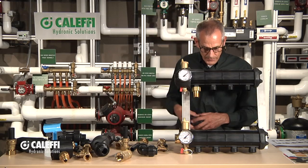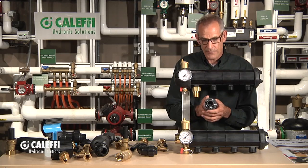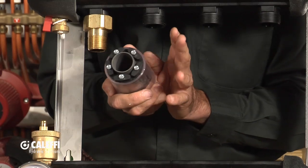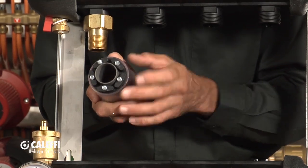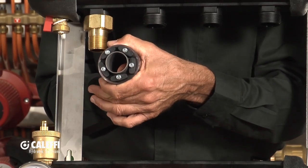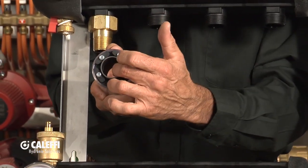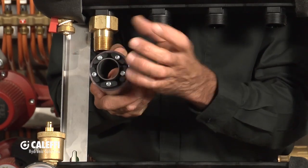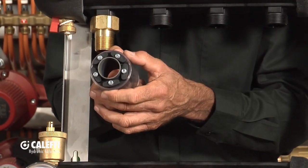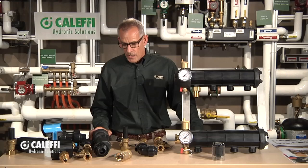The last thing I want to show you is our geo seal. If you're coming through a foundation or basement wall, you'll want to seal that so you don't get leaks when it rains. It's a mechanical seal — you bore a hole through the wall to the dimension we give you for the tube size, stick your tube through there, slip the rubber rings around it inside the hole, and tighten the nuts with a quarter-inch nut driver or a cordless screwgun. Tightening expands it outward to seal against the foundation wall and also expands inward to make a tight seal around the pipe.